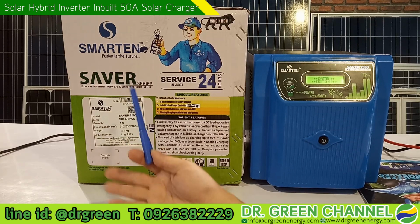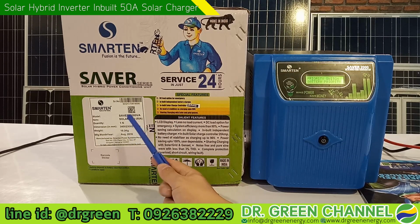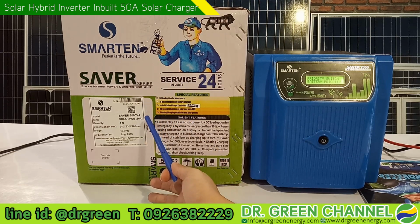So in the normal use case, you have to manage it so that the current does not exceed 50 ampere. For example, if you have a 300 watt panel, the current of one panel is about 8 or 9 amperes. So you can connect up to 5 panels: 8 ampere per panel multiplied by 5 is equal to 40 ampere. In this case you can connect up to 5 of the 300 watt panels in parallel together.